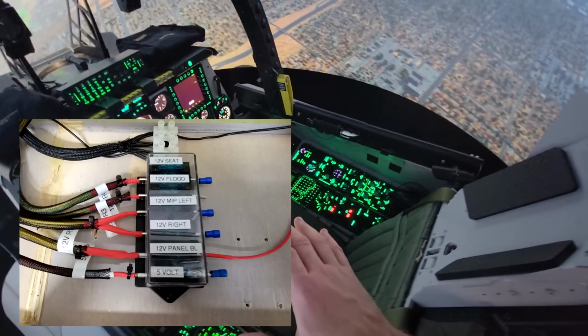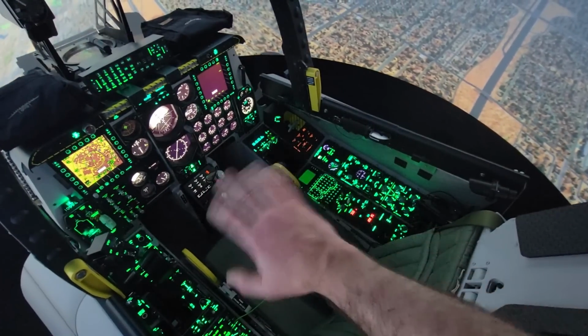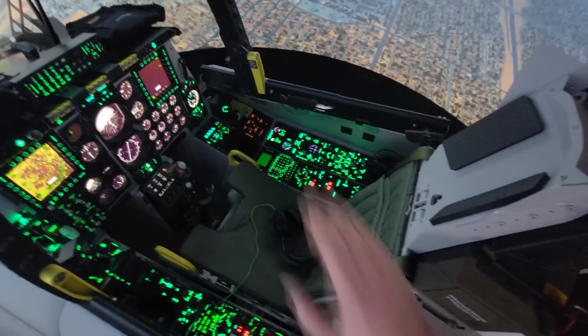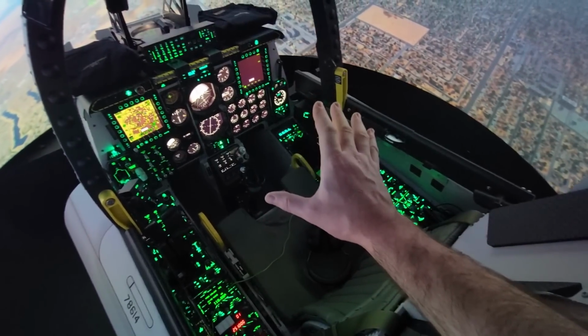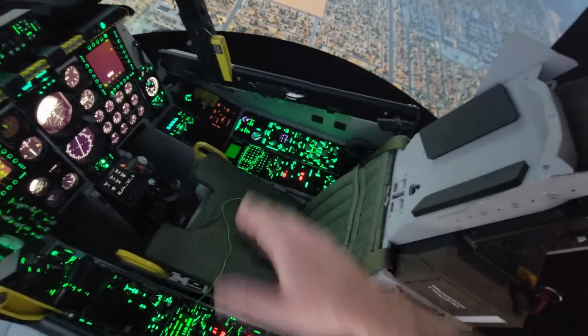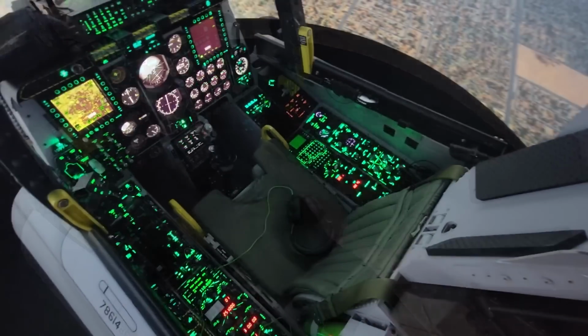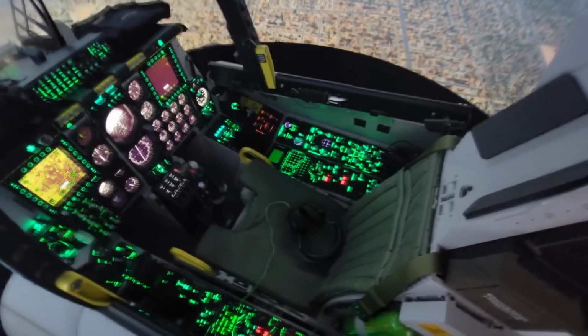There's already a surge protector on it. There's also an emergency stop button sort of concealed down there that you can't see. It's black, but you just hit that and it kills power to everything. But now there's fuses as well, so if there is a short, it won't just trip that one fuse on the power supply. I'll at least be able to narrow down which fuse blew. So there's a fuse for the backlighting, there's a fuse for the 12 volt power, there's a fuse for the 5 volt power, there's a fuse for the flood lighting, etc.